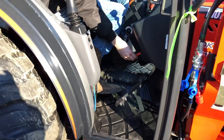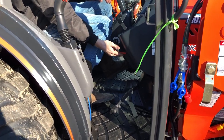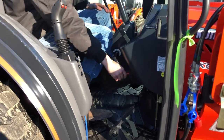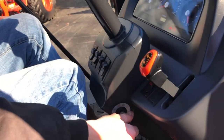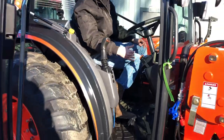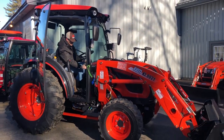So this is the linked pedal kit right here. This is a lever you're going to activate by pushing down or up — right now, up is going to be on. If you do have the tractor on, the linked pedal light is going to come on the dash. We'll start up the tractor. Linked pedal is currently off, tractor is just at an idle. We turn it on — notice it illuminates over here, that's linked pedal on. Now we're going to crack the throttle to about a third, give it a little RPM so we're not bogging the tractor down and going from zero to 100.